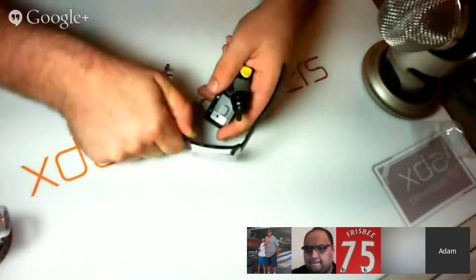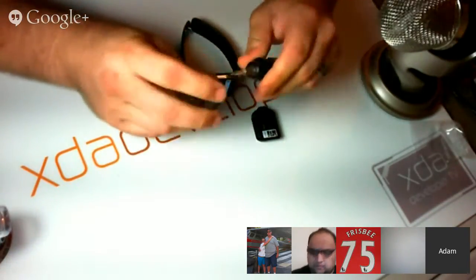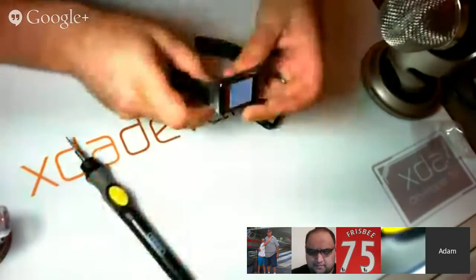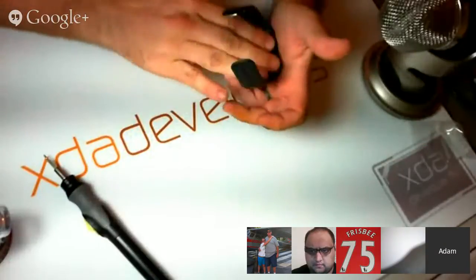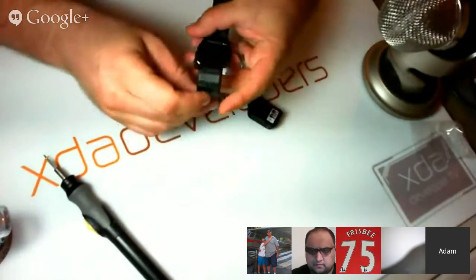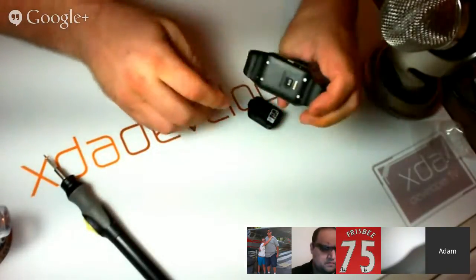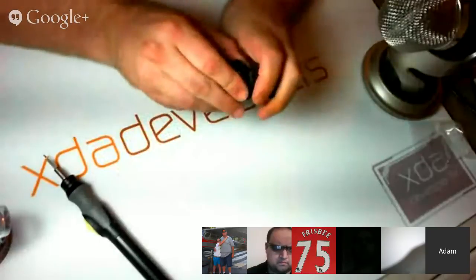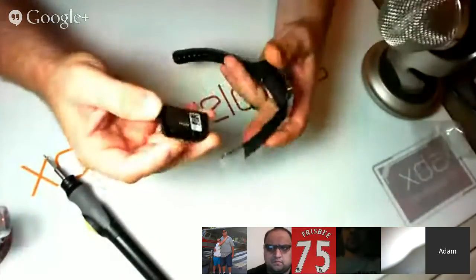I'm not saying that they're using it abnormally or anything, but I do work a lot with plastic in my line of work in a hospital, biomedical equipment technician. What I see a lot of the times is people will wash things down with types of chemicals that will make plastic more brittle. And what ends up happening is things chip and break where they're not supposed to when the plastic becomes more brittle. Whereas this whole mechanism here is designed around the movement of the plastic to conform to the watch. And once it becomes more brittle, of course, it won't move. It'll just kind of snap off.